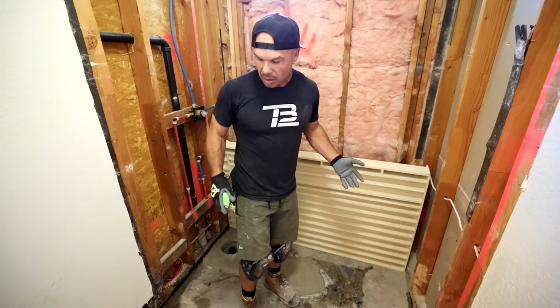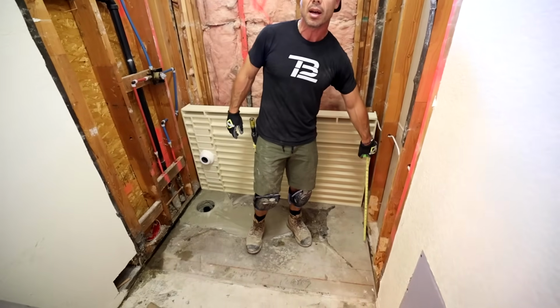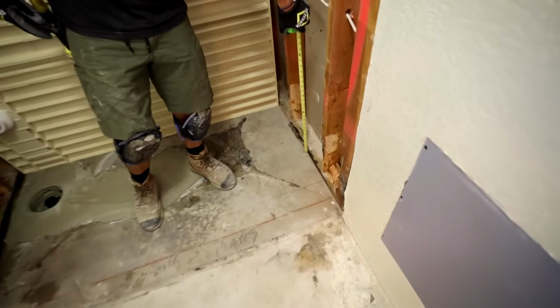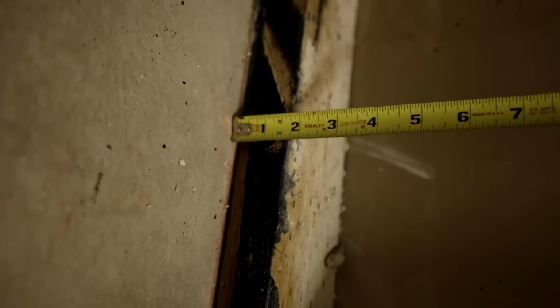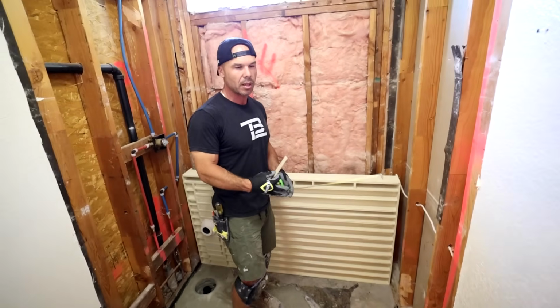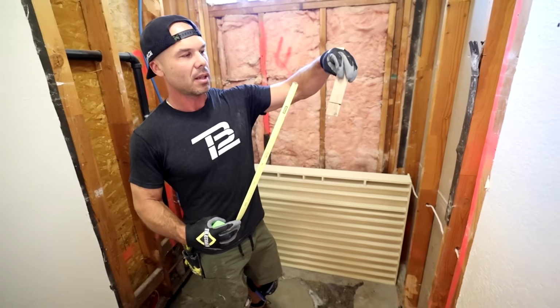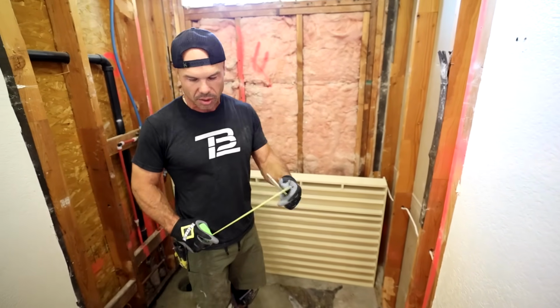So what's neat is I kind of have a good plan, because 1.5 inches is a good measurement, because that's the height of the bottom plates. The bottom plate's 1.5 inches, so that'll be good to screed everything off of. And then we also have a stick that has 1.5 inch gauge on it, so we'll be checking our gauge.